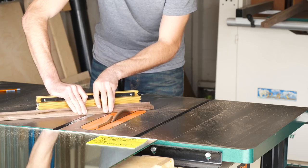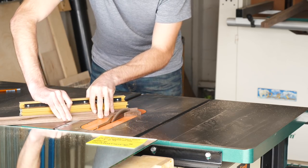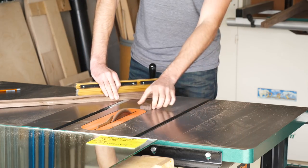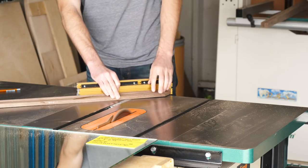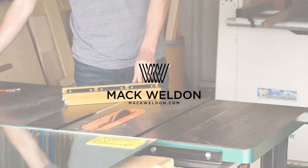Finally, I could cut my 45-degree angles on the ends of each of the four pieces, and I just kind of worked my way around the mirror, taking measurements and cutting until everything felt good. Then I attached the mirror to the wood using some construction adhesive. And while I'm doing that, let me take a second to thank Mack Weldon for sponsoring this video.